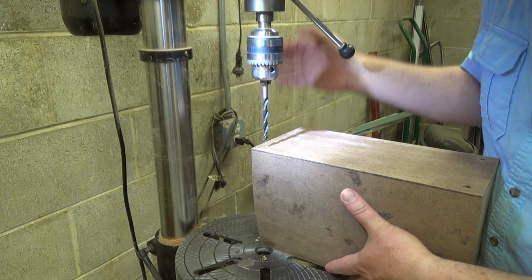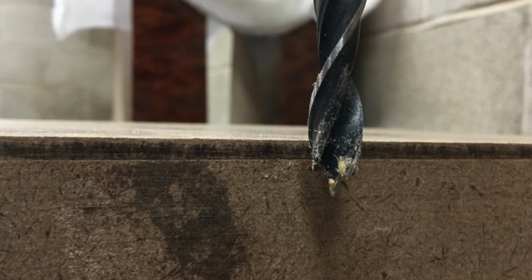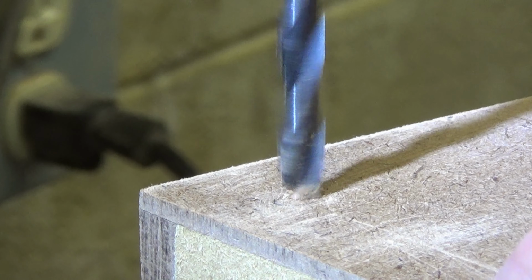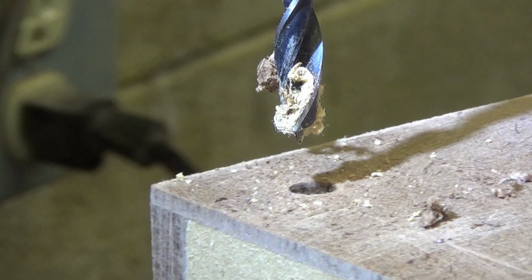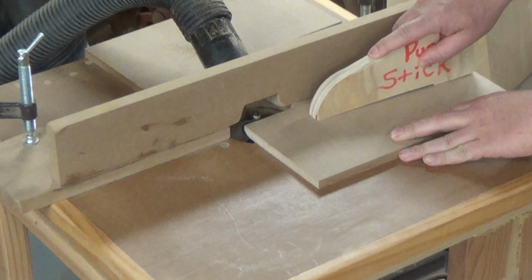Now I head over to the drill press and get set up to drill the magnet holes. I fiddled around with the depth a bit because you don't want them too deep or else they'll lose some of their magnetic mojo. A 1/16 of an inch under the surface is about right. I will be veneering over the front of these speakers, so I needed to factor any additional baffle thickness into my calculations. I next rounded over the grill blanks.